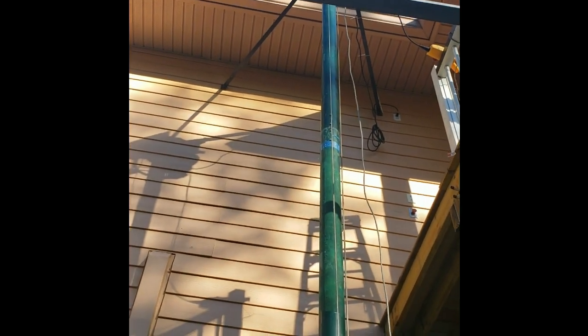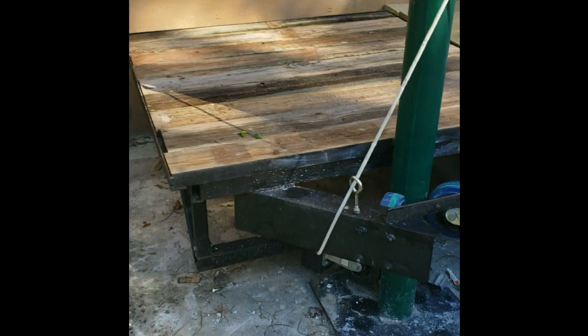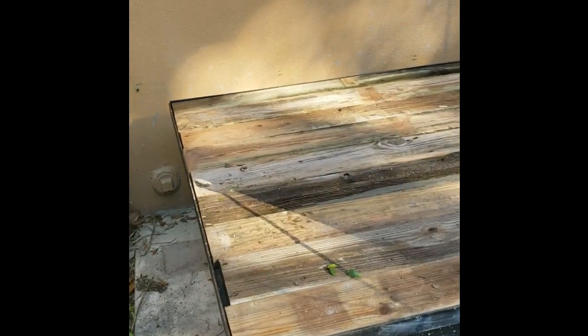There's the cable running up the pole and there's the hoist — it's braced off at the top. This pole has been concreted on the inside just for extra strength. The platform basically just sits on some rollers that roll up and down on it. It's a pretty simple design. We still need to put a couple of casters that are going to ride on a track up against this wall, going straight up to where the second floor ends — possibly a foot higher. That's going to act as a guide and give a little ability to lean on the wall, helping stabilize it.